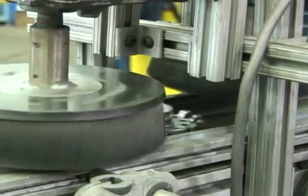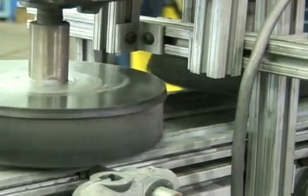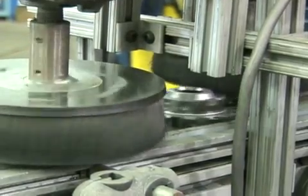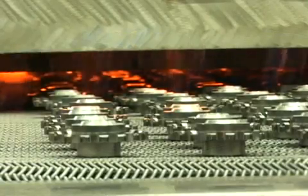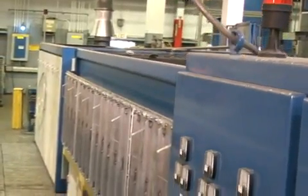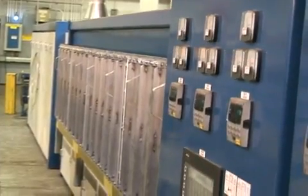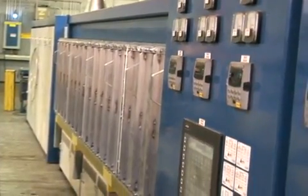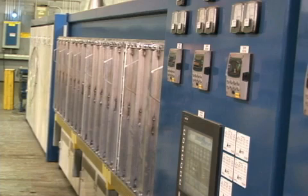The compact has the appearance of the finished component, and its green strength — the mechanical bond between the powder particles created through pressure — is sufficient for it to be handled, whether by an automated system or by an operator's hands, as it's moved to the sintering furnace. As the parts travel through the successive zones of the sintering furnace, they are subjected to a gradually increasing temperature. This heat removes the lubricant and eventually causes the metal particles to bond on an atomic level.